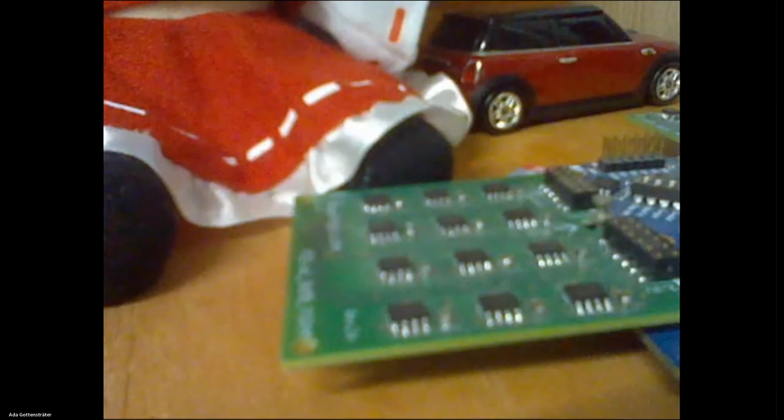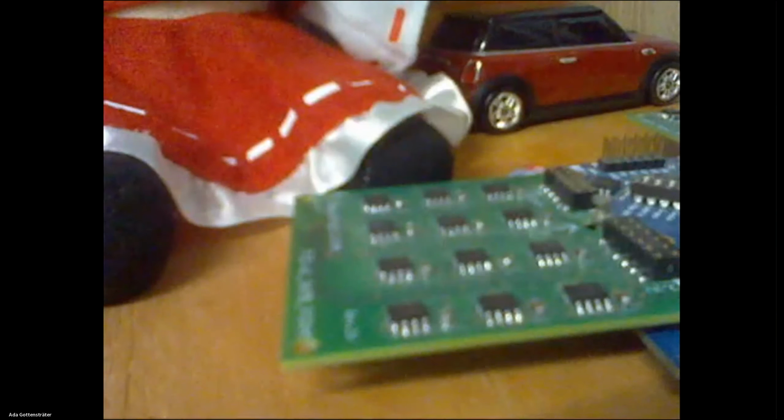They're very funny and clearly developed by very smart people, especially the YM2610 OPNB that's used in the Neo Geo, because they cut down the number of channels to 4. Now, the reason the chip has 2 ports to begin with is because there are so many registers that for 6 channels, they couldn't fit them all into 1 port.